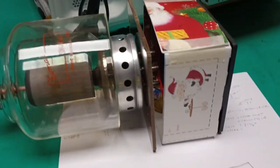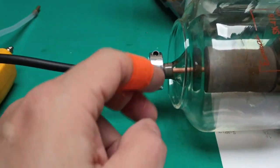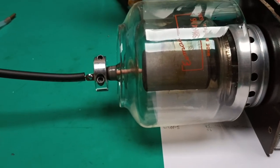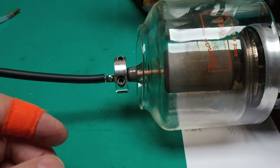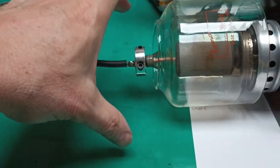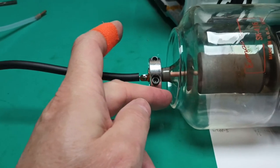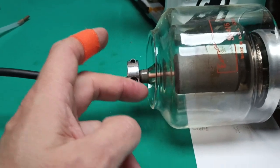And I get it. That's how I had this unit set up. But on second thought, that might not be good. On the outlet of the chimney, between the chimney and the tube, that's a large opening. When I removed this, there was an extremely small drop in pressure, implying that this opening is big enough to make almost no difference. So it should be a case where if this is opening up into an enclosure that's a huge manifold, in the case of 2 tubes, it'll be a manifold because it's combining the flows from both. And if there's a hole someplace or screening that has sufficient opening size, then there should be no need for a suction fan.